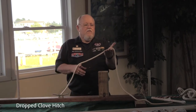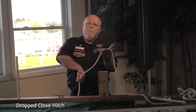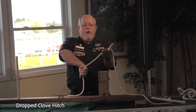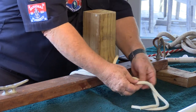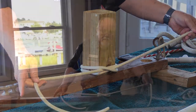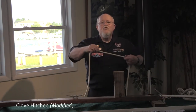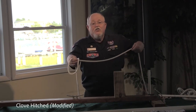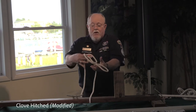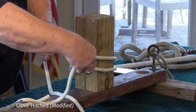Modification of the clove hitch: leave yourself plenty of room to work. You have one line crossing your palm up, one with your palm down. Turn them inward and drop the line over, draw it tight. Another variation of the clove hitch is made by creating two eyes — dropping one over the top, going in the same direction, and one underneath. Take the two eyes you created, drop over the stanchion or bollard, and draw tight.